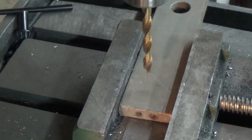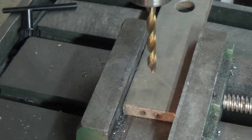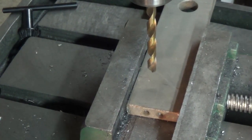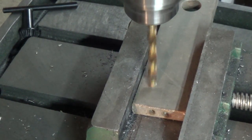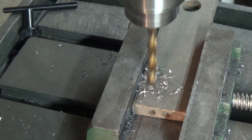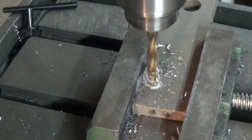All right, we're going to do some drilling. I've got a random piece of steel in here. I don't know what hardness it is, but it's probably not wicked hard. So, what speed are we going at here too? Yes, that's pretty good. So let's give her a couple of drills here. Now this is the one we sharpened and split the point back onto it to the 118 degrees. So hopefully she's good. So she's pretty good. Pulling off nice curly cues like that.